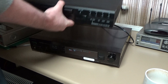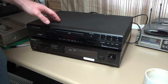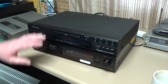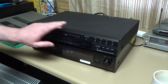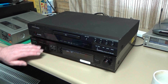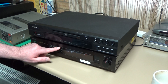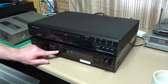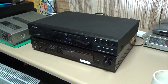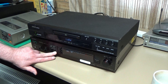I'm going to use this DVD player as a source of audio just to try this out. One second, I'll get this hooked up. Okay, we're hooked up — analogue outputs from this DVD player into the analogue inputs of the Sony. I've got the input selected as analogue, 16-bit resolution, and copy, auto, ret, mute, and tracking all switched off. So if we hit play we should get some audio going into the Sony.